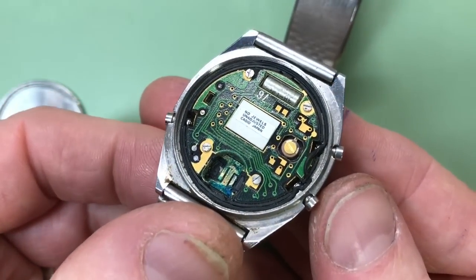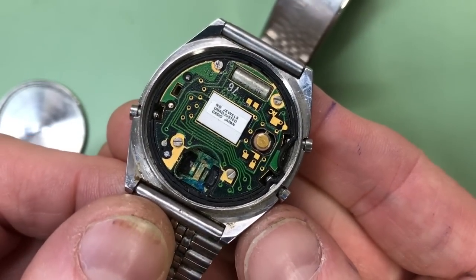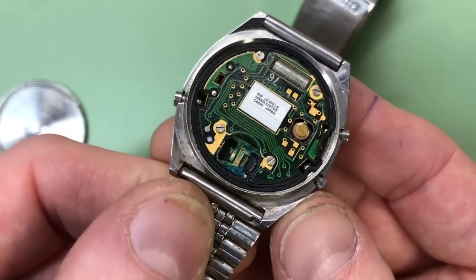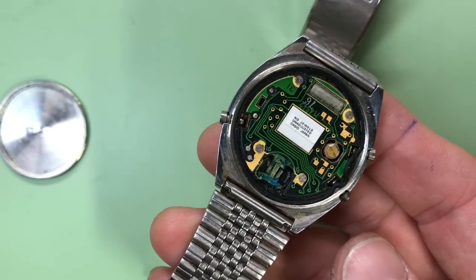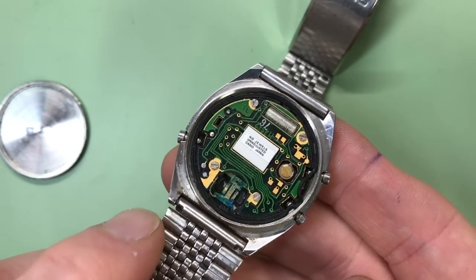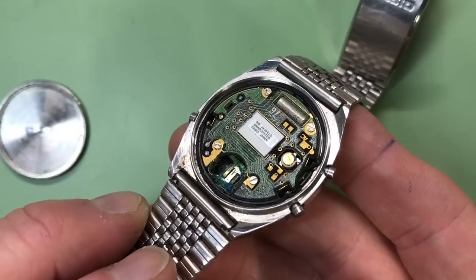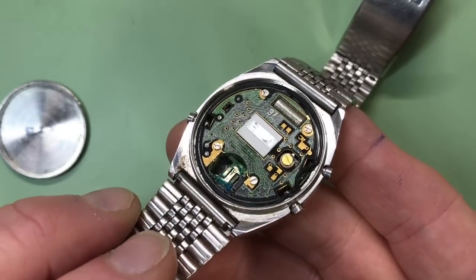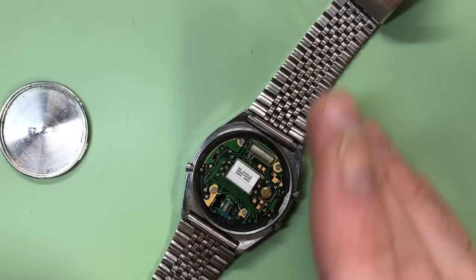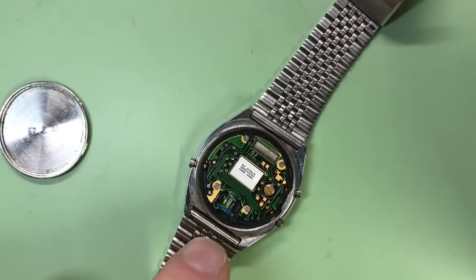What I've noticed is the circuit board looks pretty clean, but obviously inside the battery compartment there is some serious leakage. We'll need to take the module out and clean all that as best we can. While we're in there we may as well clean the board, clean the contacts on the screen, strip it all back, and put it on the microscope for a closer look.